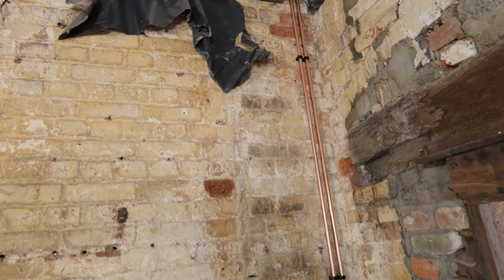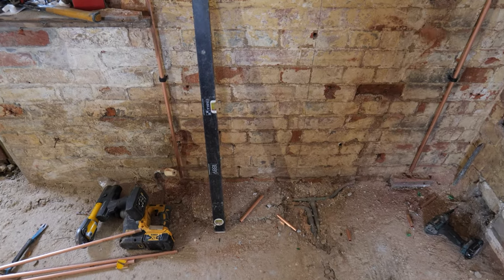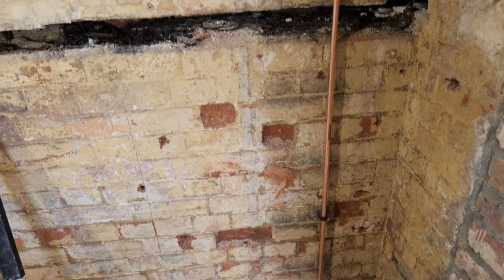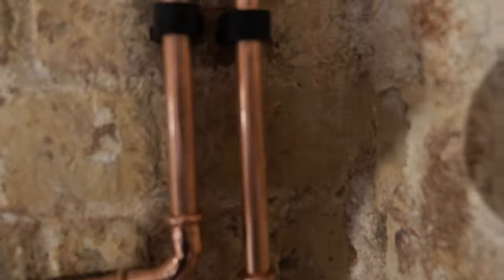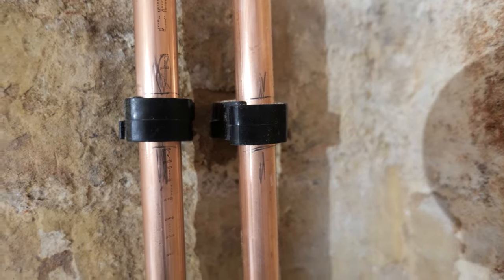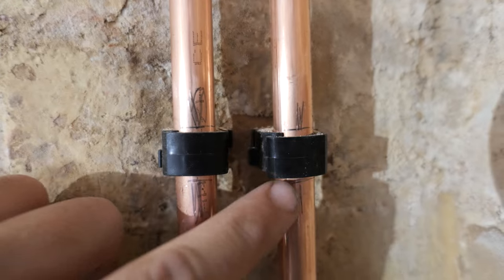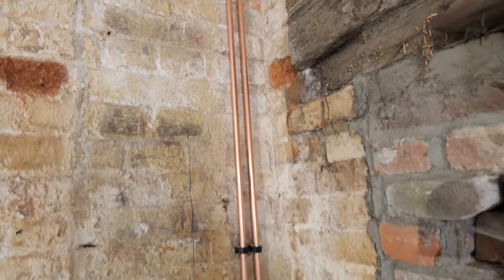I've got the first drop in now in the kitchen. We've dropped the pipe down directly where the TRVs are going to be — the reason being so we don't drill back through them when we're hanging the radiators, so there's no chance of popping a screw through it. A little tip: when you're using press fittings it's always good to mark the pipe around the clip. Put a line on the face of the pipe and a line either side of the clip — that way you know when you're pressing it that both bends up there aren't spinning around and going out of square on the first floor.